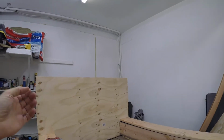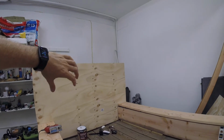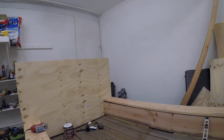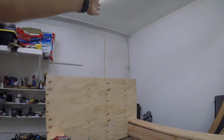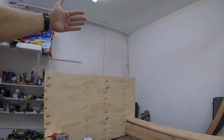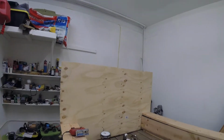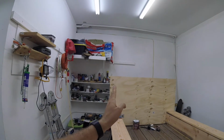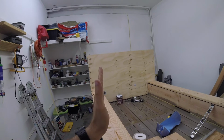So I decide that the door is going to be, let's say, 24 inches wide. I find out where center is, and I run two corresponding 2x4s up, and those are going to traverse the bottom board and go into the top board. Then you lean the top board onto those 2x4s from the other side, and you put a couple screws in it, and then you have the back wall in place, and then obviously the whole thing gets reinforced. The wall sections are going to go in between here, lateral reinforcement, and then the walls are going to come up. That's all going to be sheathed.